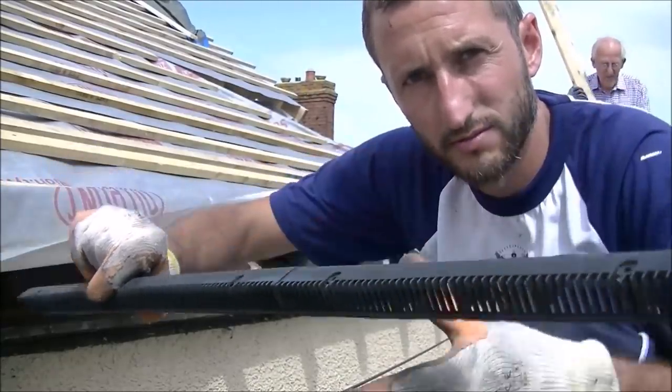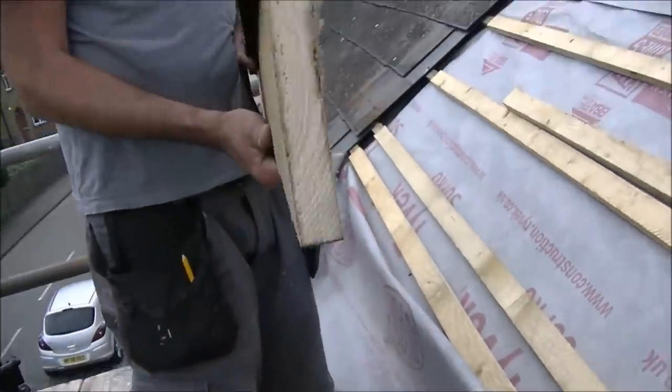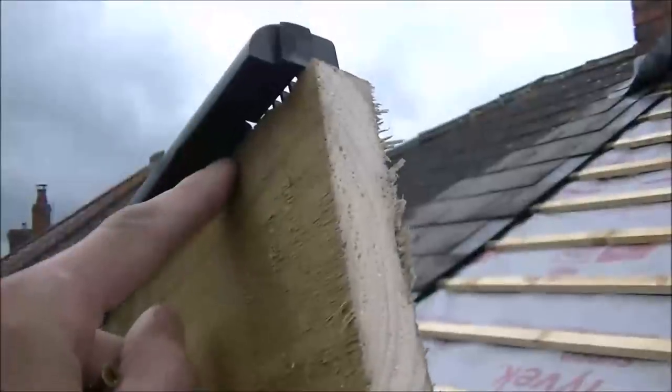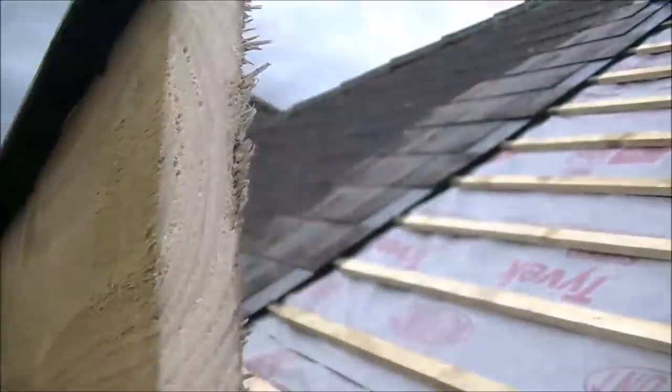On these ones it goes left to right. Just to show you a quick example of one screwed on — this is the way the fascia is going up. You've got your vent on the inside that goes under your felt, screws on the top, and it's as simple as that. If you look along there you've got these little hooks that hook nicely over so it sits into place, and then we just push this up.